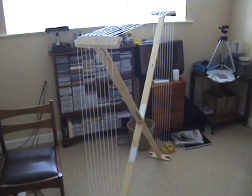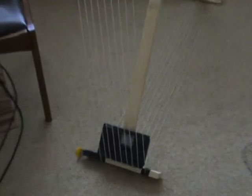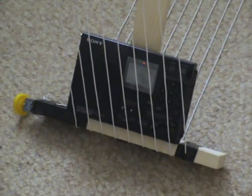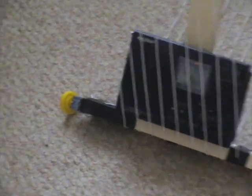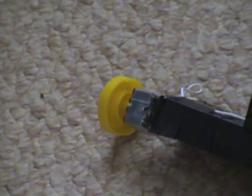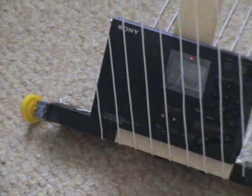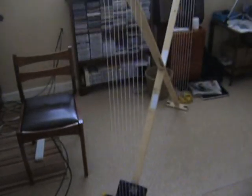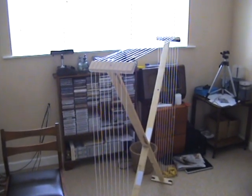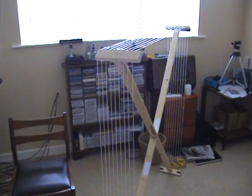This is my new 4 foot wide loop, and there you can see that it's big enough to hold a Sony portable receiver, tuned with a little variable capacitor from a kids crystal radio set. It's 9 turns of bell wire on a 4 foot frame, and the spacing is about 2.2 cm.